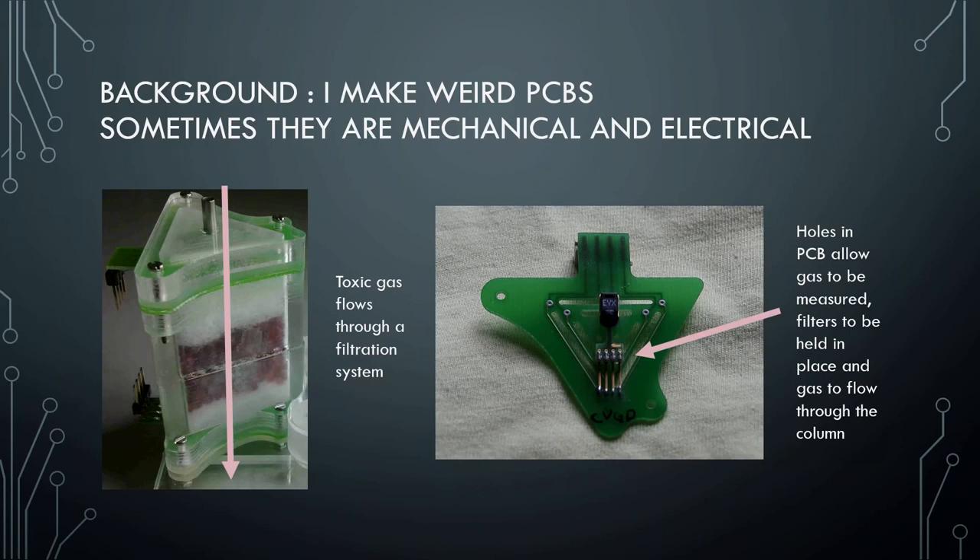The purpose of that particular PCB — basically, this is a column used in chemical chromatography or liquid chromatography to separate chemicals by different properties. I needed to buffer humidity that was reaching poison gas sensors without losing the poison gas measurements, because the sensors my colleagues were designing were cross-sensitive to humidity and to the poison gas we were measuring. So I built a zero-energy system to remove or buffer the humidity. Inspired by a bathtub drain, I built this PCB with the humidity and temperature sensor in the middle and slits so that air could go through. That's sort of how me building holes in PCBs got started.